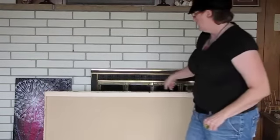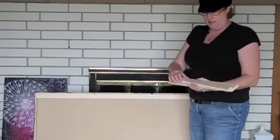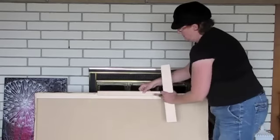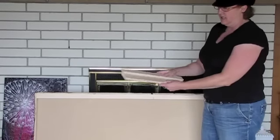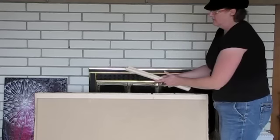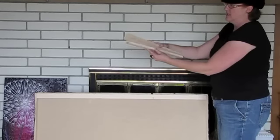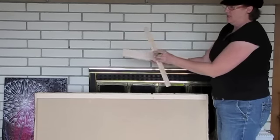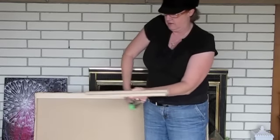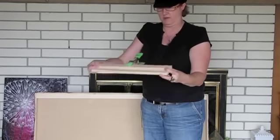I'm going to put a couple of nails across the top. I've given this a few minutes to dry, and now I'm going to start working on the piece I'm going to put onto the wall. I cut a piece of sanded board, probably about 18 inches long, to give me two points to put into the wall. I cut another board the same length and same width as the holder piece, so it will go onto the wall with the screws and the painting will hang onto it. I'm going to glue this together before I drill the hole to put the screw through, just to make it a little bit easier to work with — just some wood glue and a clamp. I'll let it dry for about 15 or 20 minutes.